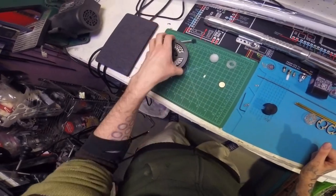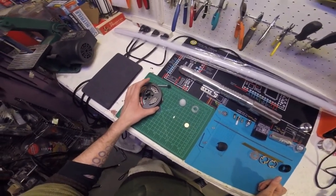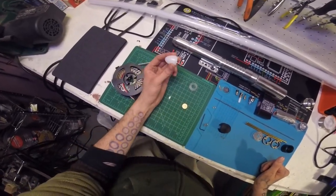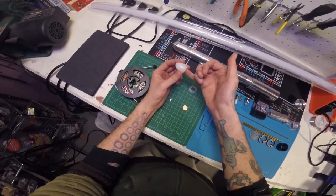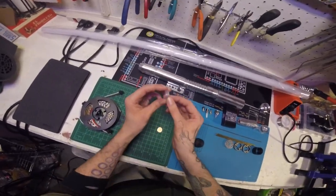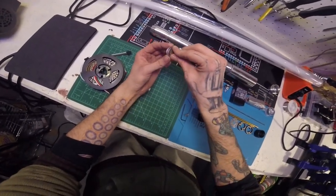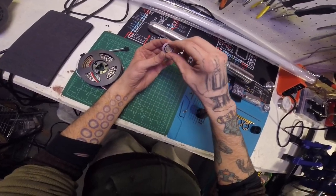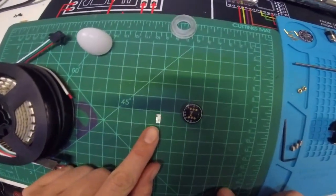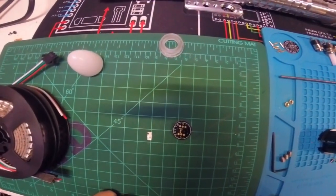These are 144 pixels each and each one's about three feet long. Since I'm going to be making a shorter blade I'm going to cut some of these pixels off. On the end of the blade we have a tip which is hollowed out so that you can fit a pixel inside of it and have that light up as well as the rest of the blade. On the other end we get this NeoPixel connector adapter, into which slots our NeoPixel connector. The last piece of the blade is this tiny little resistor which gets soldered onto those two little squares in the middle of that connector.